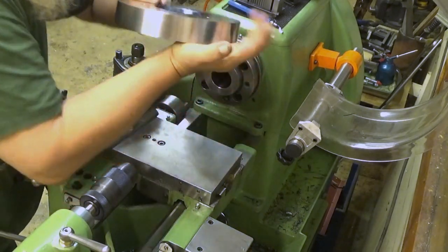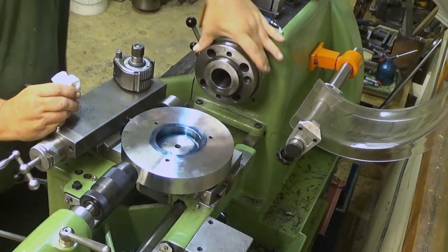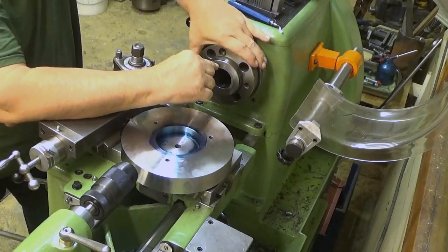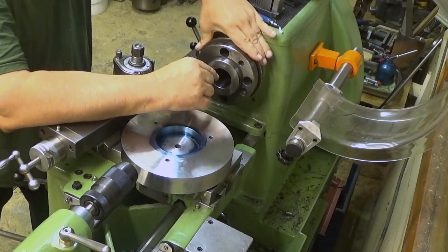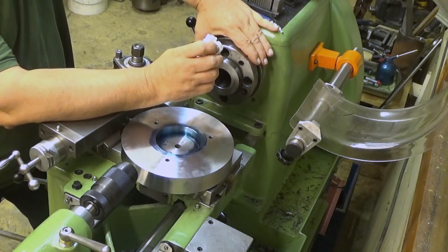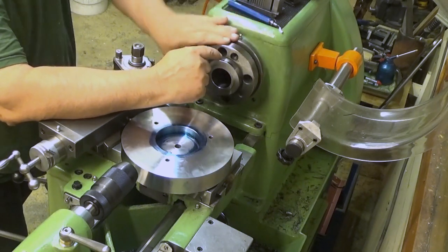Take that away and see where we have all the markings. Well, at least we don't have any markings here, which is a good thing. We have a quite broad marking there, probably. There. Well, it's mostly on the end, this end of the taper. So the taper is not entirely correct, but I believe... Oh, no. We have faint markings also near the...